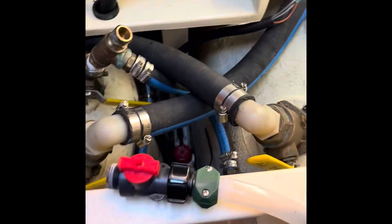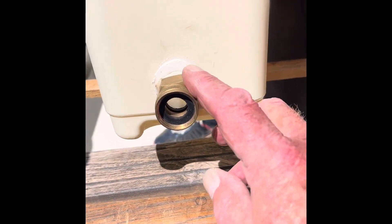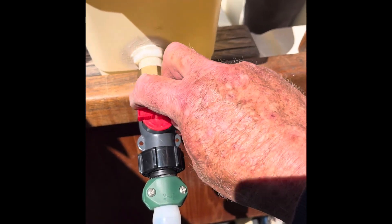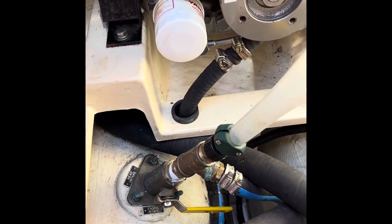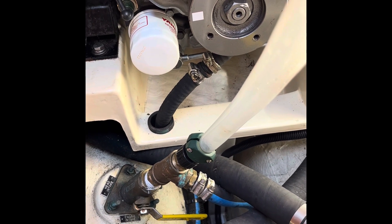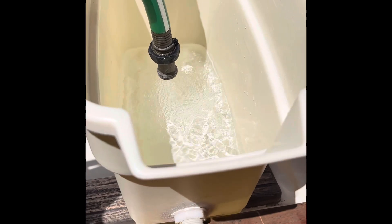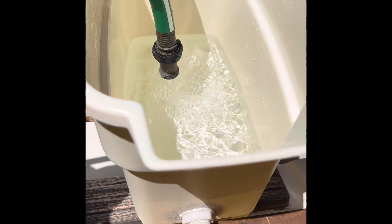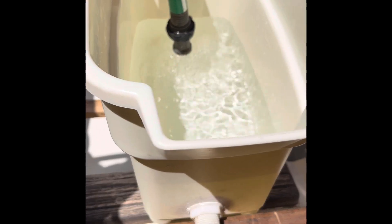Use the wrench just to tighten it a little bit. Then we have a hose that goes up to the bucket, which also has a hose fitting on this end. We've got the hose hooked up to the bucket now, and it has a valve so we can turn that off when we fill it with water. It comes down and goes into the fitting on the water intake. You don't want to hook the hose directly up to that fitting because you'd pressurize your system and run water in and fill your water-lift muffler up — you've got to let the engine pump the water through.